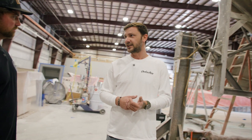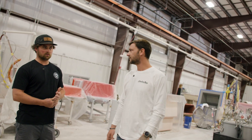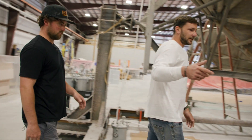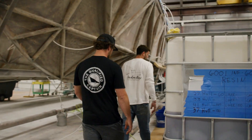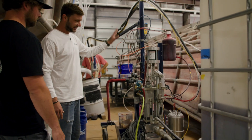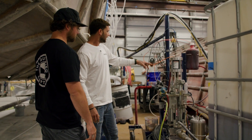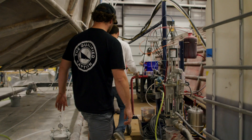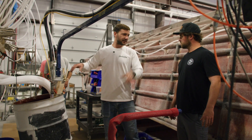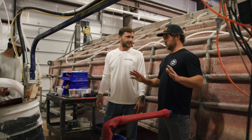The vacuum infusion process starts with vacuum — bags are already sucked down, all that good stuff. Here's the resin — it goes through this machine. It's pumping now. Resin's going through here. The resin's going through the machine at the end of the head and it's mixing with the catalyst. Everything going into that barrel right now is catalyzed and it's dialed in perfectly.